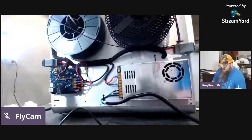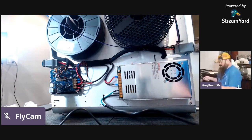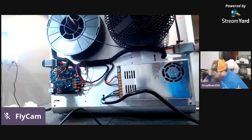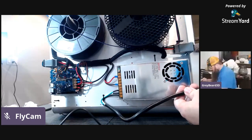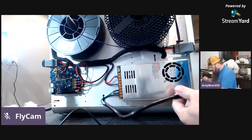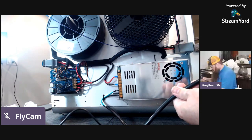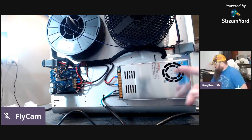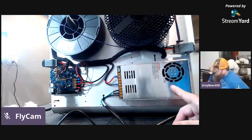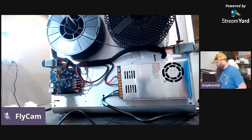Fortunately, it looks easy to change the cord. It is pretty heavy duty. I do like that. It seems to be the right thickness. Let's see. What gauge is this? Okay, so it's 14 gauge. 300 volt. Yeah, all the usual stuff. But 14 gauge is pretty good. Is it a 400 watt power supply? So you actually don't even need it this thick. I think you can go to 18 gauge if you wanted to. But I digress. Let me go find an extension cord.